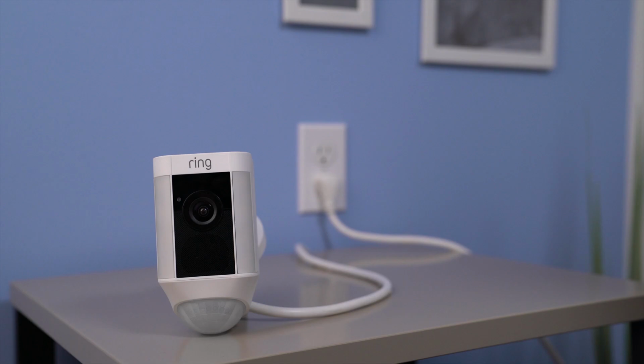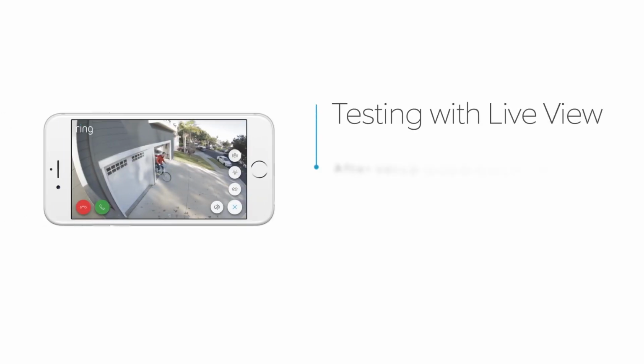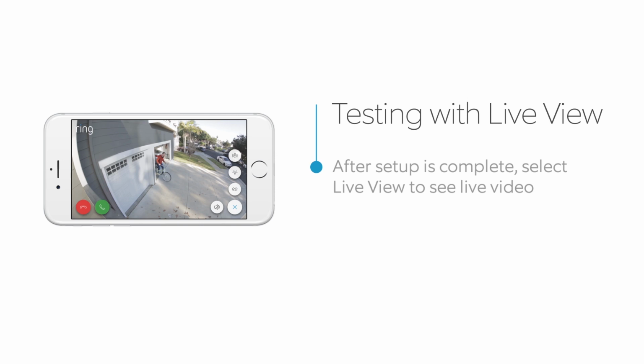Once you've finished setup in the Ring app, your Spotlight Cam may start flashing white and tell you that it's updating. If this happens, do not unplug your Spotlight Cam. Wait until it stops flashing before continuing. After setup is complete, select your Spotlight Cam in the Ring app and tap the Live View button to see live video from your Spotlight Cam.